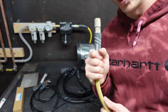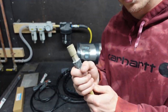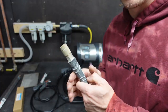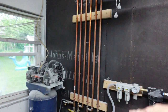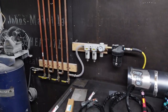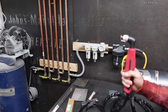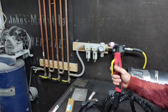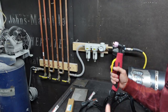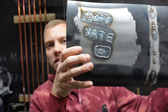One important thing before we get to cutting: the air going into your plasma cutter must be extremely dry. They give you a water separator with it, but it's very important that the air from your compressor is as dry as possible. I built a copper piping system in a previous video to dry and cool the air, with filtration, water separators, and a desiccant dryer. If water runs through your plasma torch to your tip, it will ruin the tip very fast — your tip starts to blow out and you can't use it.